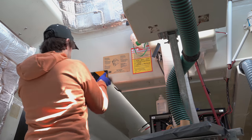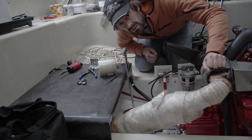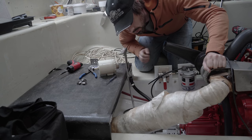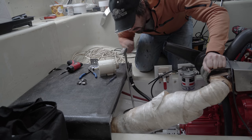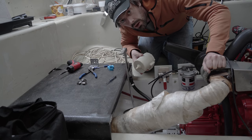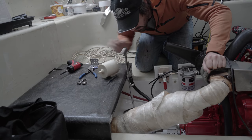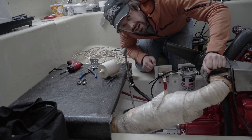Now we'll head down to the stern gland, where the prop shaft exits Alan's interior. One thing that I thought originally I might be able to salvage from the original installation is the oil supply system, which runs down to the stern gland and lubricates that when it's running. So this is the original reservoir, which just takes normal engine oil, and then there's a hose which runs with a couple of Jubilee clips down to the stern gland itself.